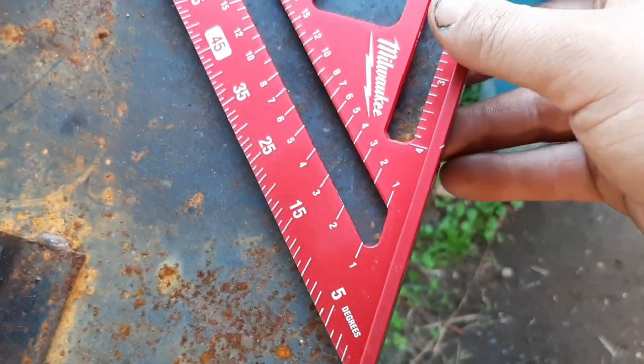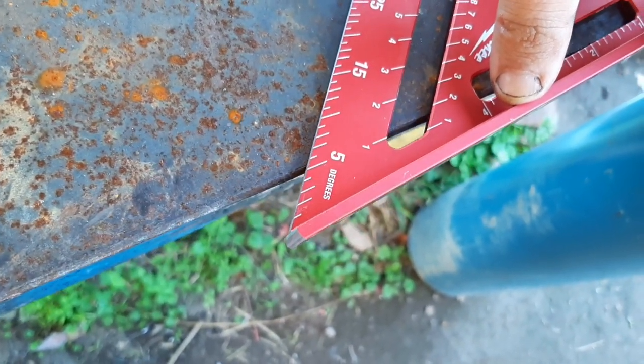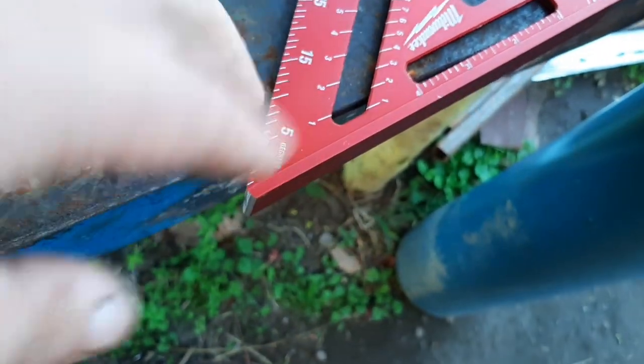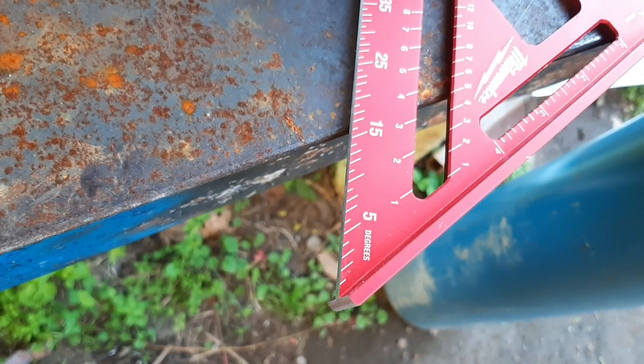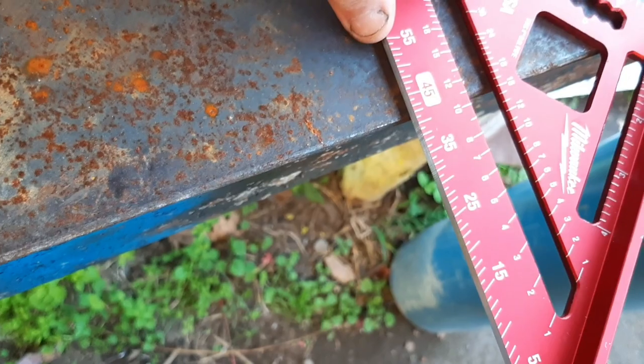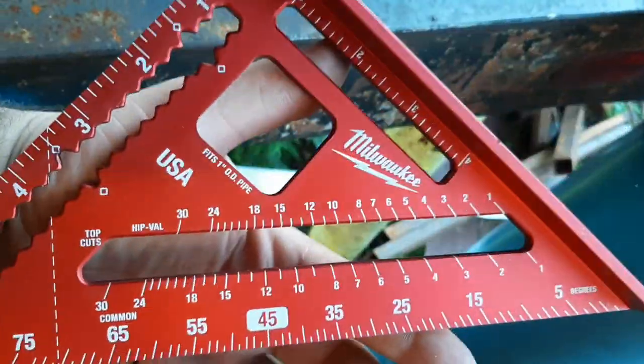Another really, really good thing about these is they do angles — yes, they do angles. This is what is so fantastic about them. You're trying to find an angle on something — right here where it says 'pivot,' that's your pivot point. Five degrees means that this line right here is five degrees off of this. That line is 10, 15, 25, 35, 45, and then 55, 65, and all the way around until we go back to 90. That's one thing about these I love. And they're just invincible — they're fantastic. You can't kill speed squares. You just can't. Unless you like run them over.